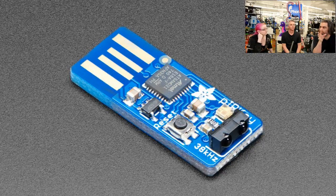It's like a universal accessibility device that's also Python. It shows up as a keyboard and a drive — the drive has code on it. The IR key was originally not programmable because it had an AVR, so it came with a remote and you could only use it with that remote. With this, you can use it with any IR device — anything around 38 kilohertz, which is pretty much everything. You read the raw pulses, paste it into the example code we provide, and select what key commands you want to send. We have multimedia key support now. This is great for assistive technology. The P stands for Python — that's the PIR key.